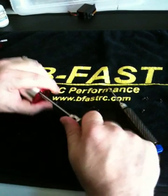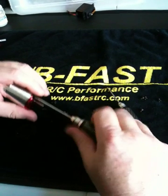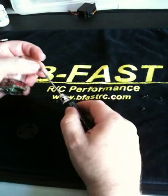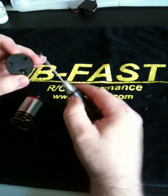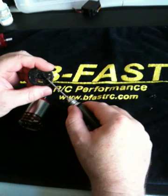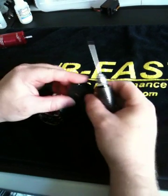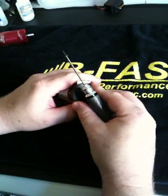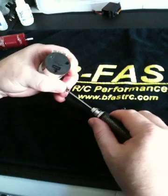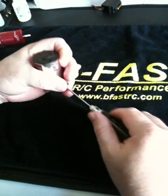These don't have to be overly tight — you are screwing into an aluminum CNC housing, so snug is usually good enough. If you're running off-road, maybe a small dab of blue Loctite will help out, but you really shouldn't need it. A lot of guys over-tighten these rear screws. What you've got to understand is this rear plastic plate actually preloads the bearing with the seat here. If you over-tighten this, you'll deform the plastic piece and it won't preload the bearing properly. So again, just snug. These really aren't holding anything together as far as the motor is concerned — it's just setting the timing so the rear end bell doesn't move around on you. Make sure you get all three in there before you tighten them up.